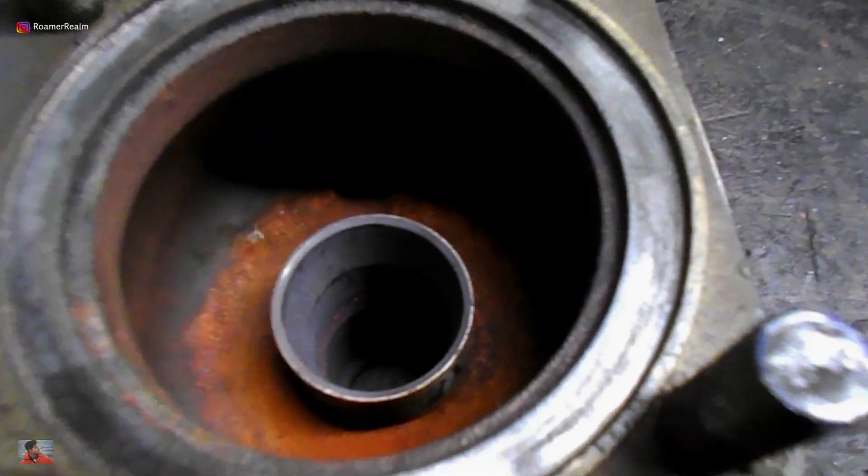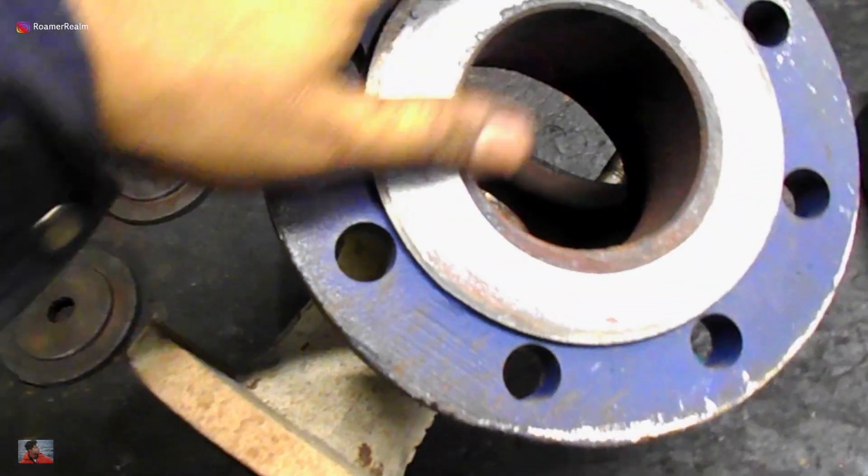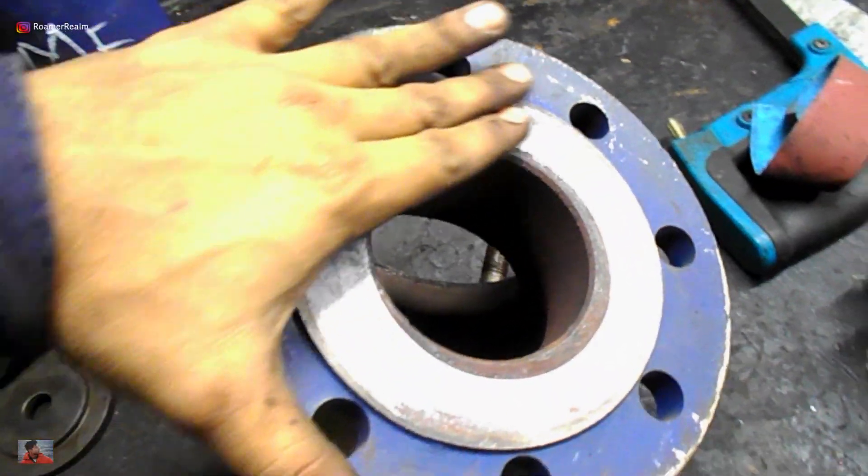The valve body is flanged for piping or mounting connections. Despite the gasket which will be installed, these surfaces need to be checked for their condition, particularly for any high-pressure steam cut, which can sometimes be the case if there was a steam leak.